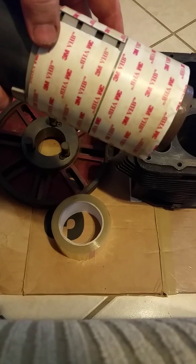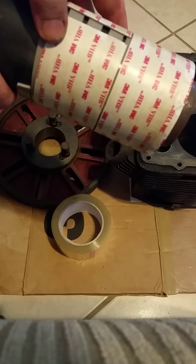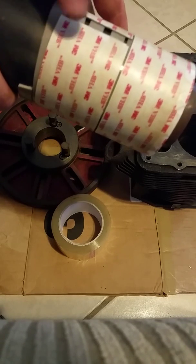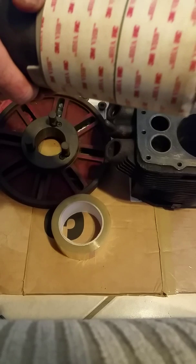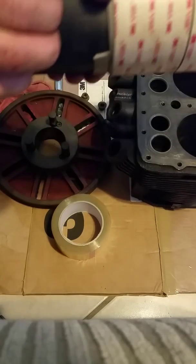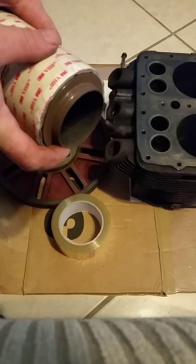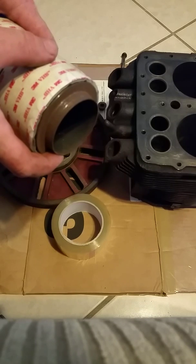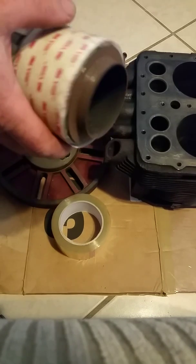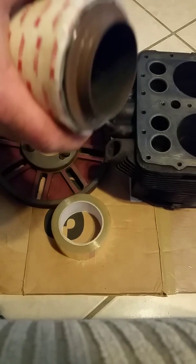So I don't want to be too far off center. I'm hoping they got it right when they originally did it, because I'm taking their center and going off another three thirty-seconds, or ninety-four thousandths, on each side. Anyway, this is going to get it centered in the hole. I cut this out in the past so that it fit perfectly in the faceplate — it's got to be within a few ten-thousandths because it's a really nice fit. It took me a couple tries to get the angle right and it worked out.